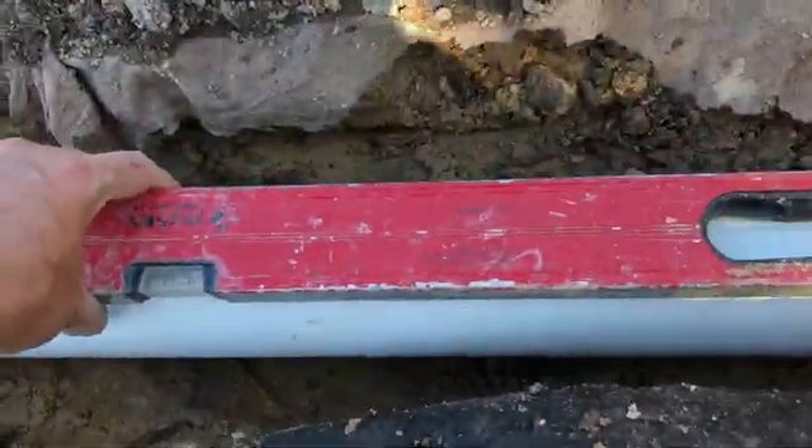All the way down towards the street we are still completely downhill to level, continuing from the other side of the fence. We are still massively downhill to level to the last catch basin. All the way down to the curb — the bubble can't move any further — so the water is going to jettison all the way to the other side. It will build up and come up through slits drilled in there so it can facilitate out through the other side. This is how you prevent your patio and yard from flooding.